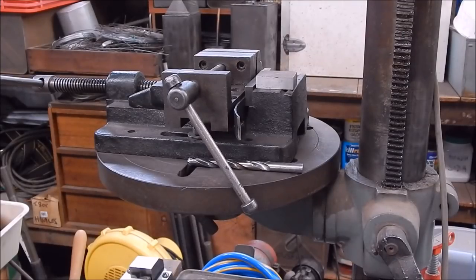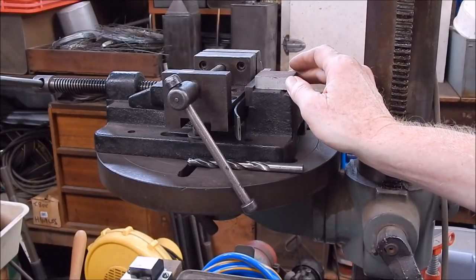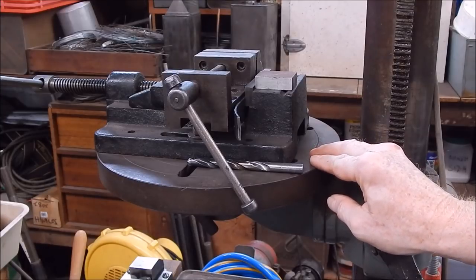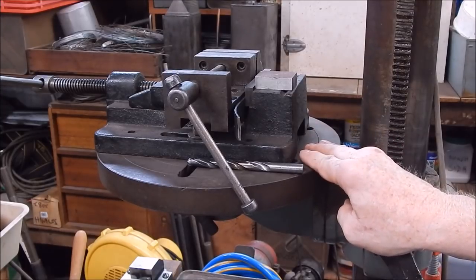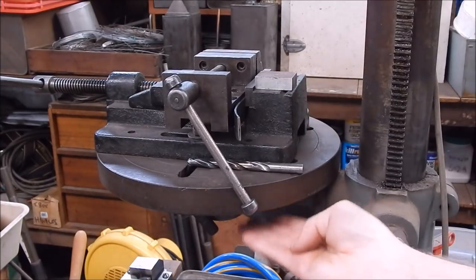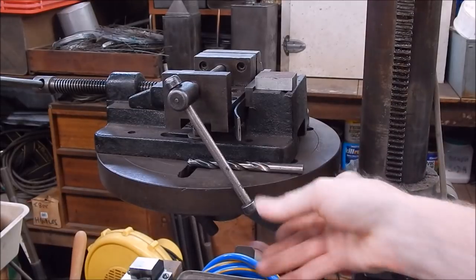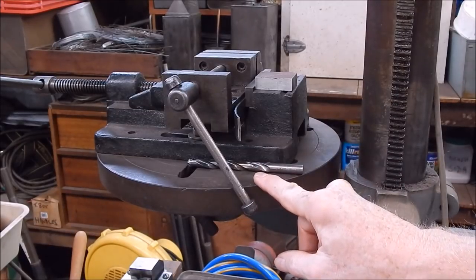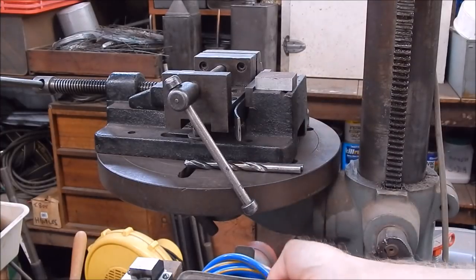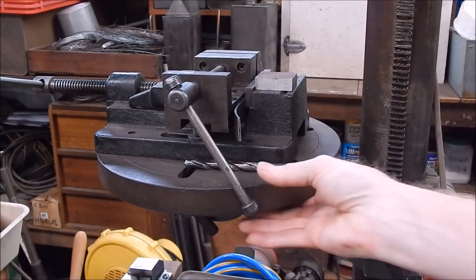To drill the two holes for the high speed steel and the bolt, all you need is your drill press or a four jaw chuck. If you do use a drill press, make sure that you put a support underneath the table to allow for any flex, because these things will flex, particularly if you're drilling big holes and you don't want to run out. So yeah, hydraulic jack under the table, easy way to stop the table canting down.